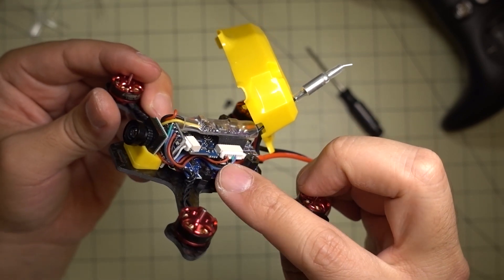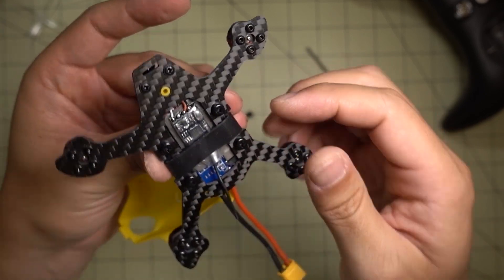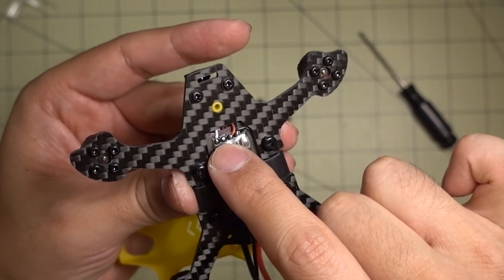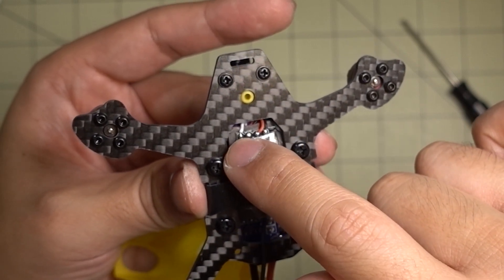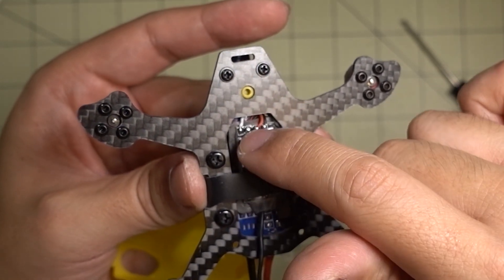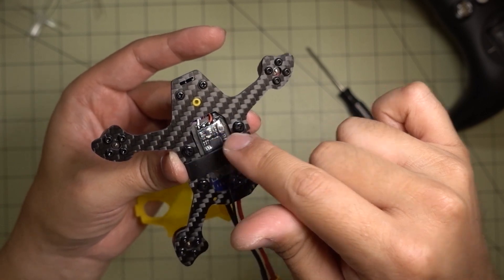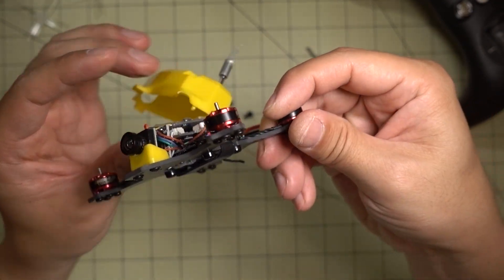I used this connector here that was previously for the PWM receiver, so before you can do anything you have to free up that connector. My particular 95 GT came with the RX2A Flysky receiver set up for PPM. If you just move over the white wire from the empty pin to the one on the corner, that's SBUS — and actually SBUS or IBUS works for this receiver. You desolder that, solder it to the one next to it, enable IBUS and serial receiver on UART2, and then this becomes an IBUS receiver. You can then use a Turnigy Evolution with the same receiver because it uses the two-way protocol.